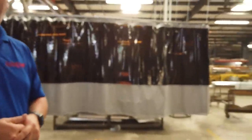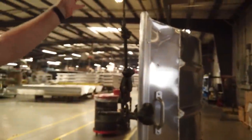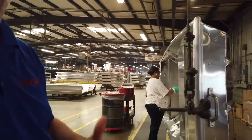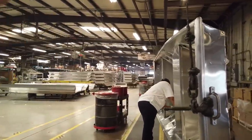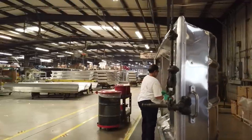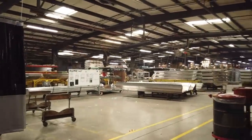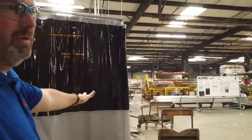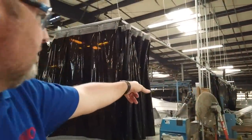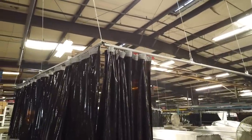For primer on the riveted boats, there's some welding done just to bring everything together, but everything else is riveted. It's just a matter of washing off the dirt and oil, then they roll it in, spray it, it goes in the oven for 20 minutes, it comes out, and it's done — a constant revolving process. Now we're on the riveted John boat line. Behind this hot works curtain is where they're taking the hull and bringing everything together.